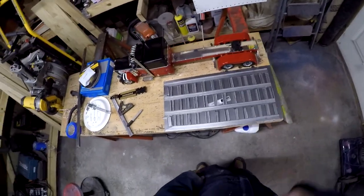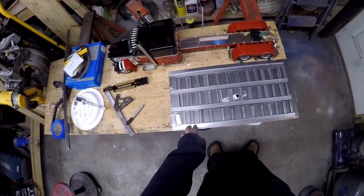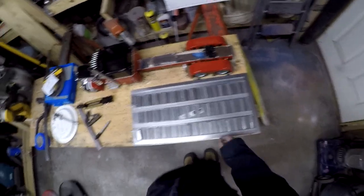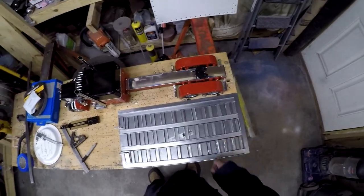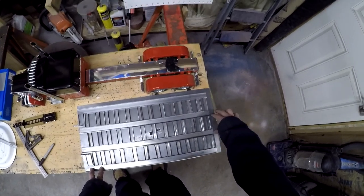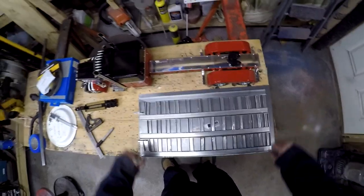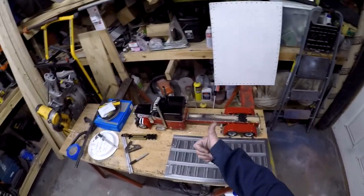Once they're welded together, I won't be able to get to the ends easily to do all my other things. Next time I'm going to make all the extension brackets — I'll need 28 little triangle extension brackets — and then make the hinges so they can pivot, get those on here along with some D-rings to tie down to. I'll also have to kick up the ends, make the back end where the axles would go, and add my front attachment points. So this is where we'll leave off for today. See you next time — hope you subscribe.